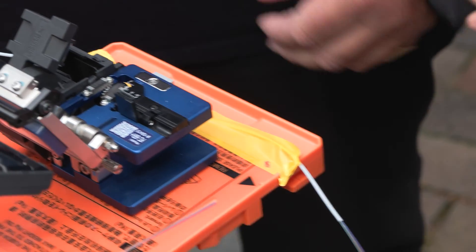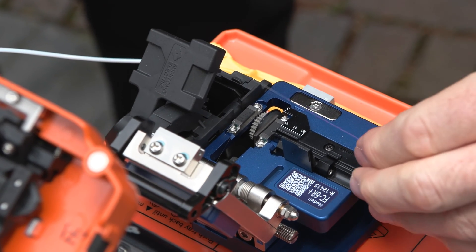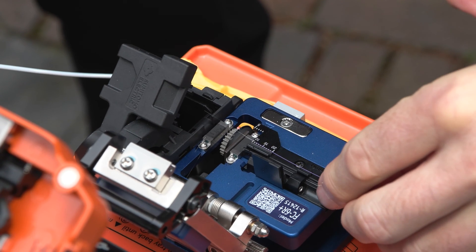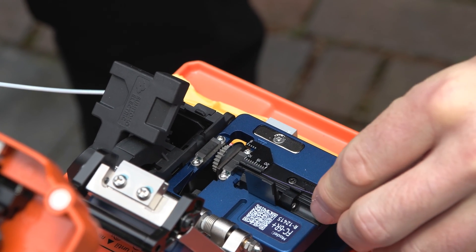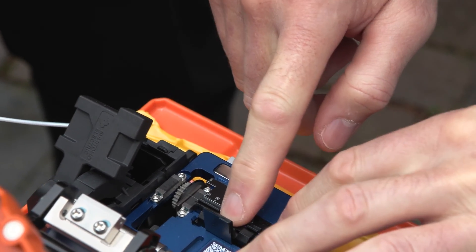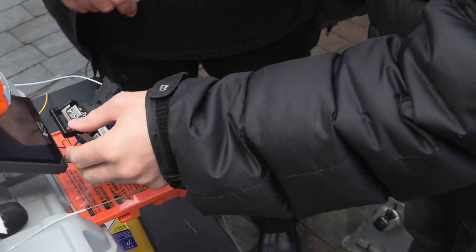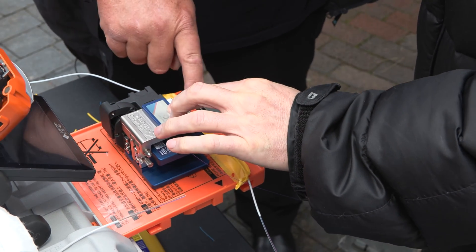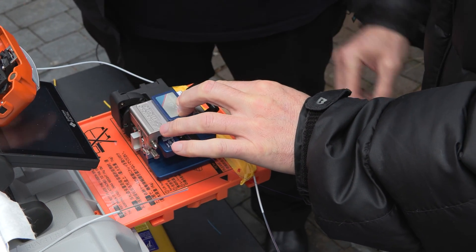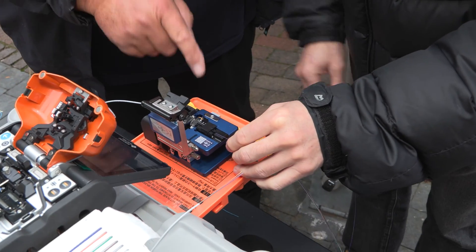End of the coating between 15 and 10 — that's correct. Now put your magnet down. There we go, brilliant. You can let go of all that now. Close this lid down — shut it until you hear it click. Then push this plunger in, lift that lid up, and that should be cut now — which it is. Grab hold of your fibre and lift your magnetic lid up.